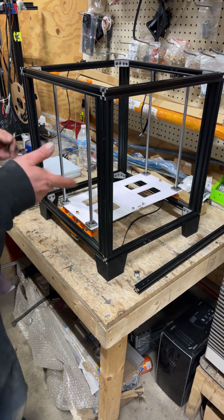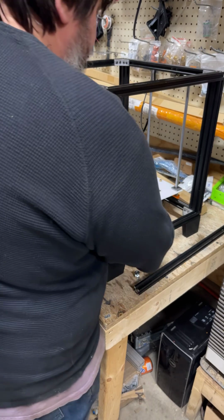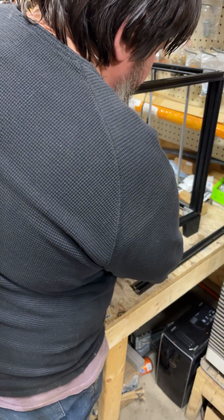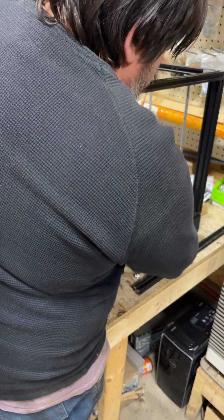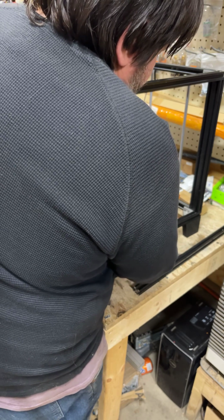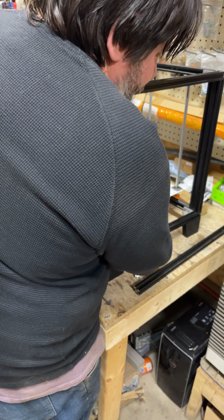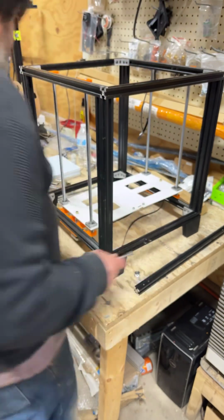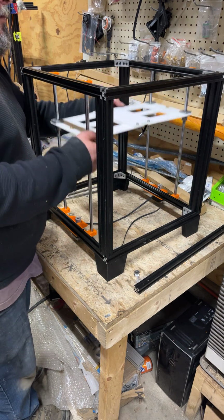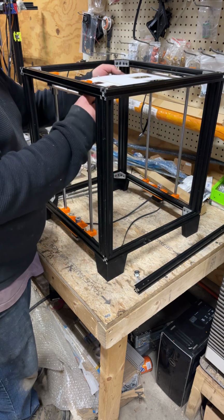And then after we're done tightening, we're going to go up and down again, make sure we haven't had any sudden changes, because sudden changes mean we've shifted something. And that's kind of the last thing we want when we're getting ready to drill a plate that you can't undrill and start over again. And so I don't feel any awkward forces.